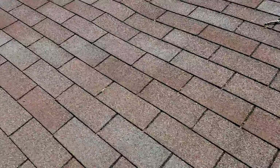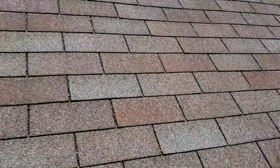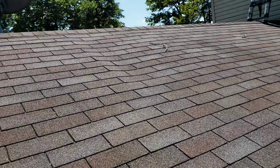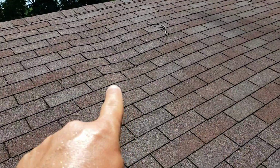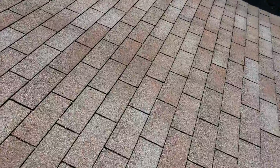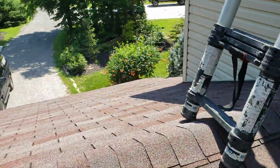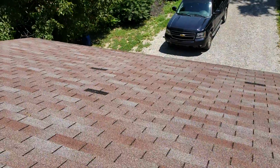Here we go, right here. Hopefully my phone's going to illustrate this. You probably noticed it before. We got a real big dip in the middle, right there, and then the more that I walk around, this garage is pretty spongy, so it's probably not a leak situation. It's probably a lack of ventilation situation where it's almost kind of dry rotted. We run into that a lot.